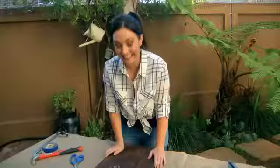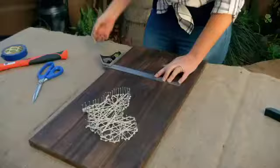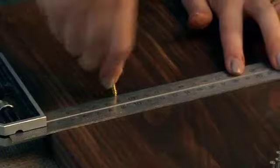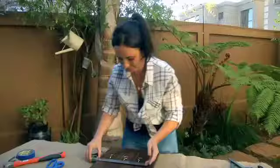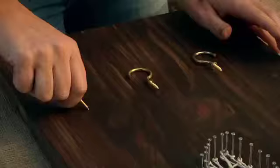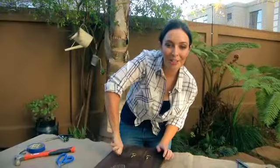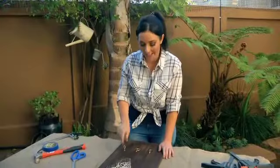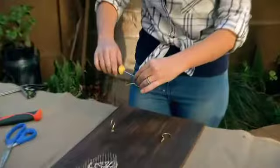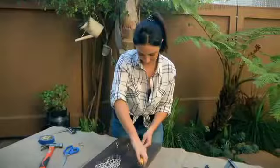So simple yet effective. Next, I'm going to put in my hooks at the bottom here. Let's grab my speed square and I'll mark one over here, and one over here. It's relatively easy to put in the screws — just find a starting point and the threading on the hook finds its groove in the wood, then you continue to push it in as it secures itself. That can get a bit sore on your hands, so here's a nifty trick: grab a screwdriver, secure it into the hook, and use the screwdriver to turn the hook around. The hooks are secure — this is where I'm going to hang my keys.